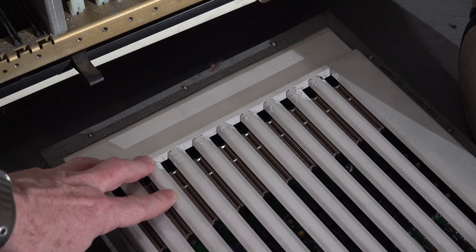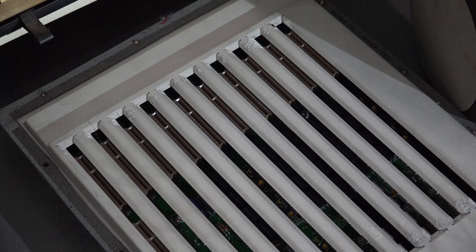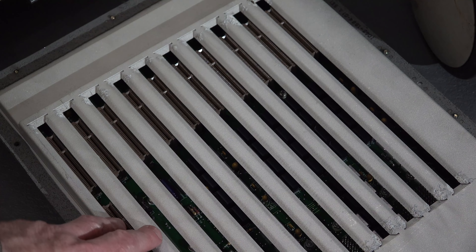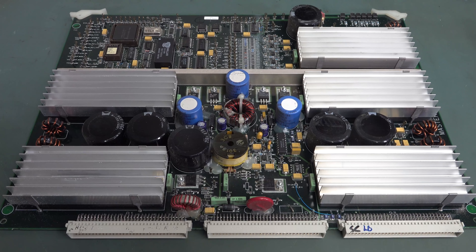This has got a huge metal plate that contacts all of the metal braid — nothing can escape. I've never seen shielding like this. There's a front panel board that those huge connectors on the front connect to — they look like PCB connectors. We'll take this whole thing apart because there looks to be a whole bunch of relays and other things that switch individual channels. Let's take a look at the individual boards from this beast. I'll provide high-res photos over on eevblog.com so you can explore these to your heart's content.